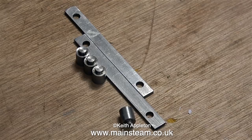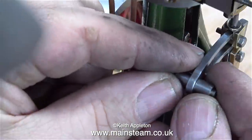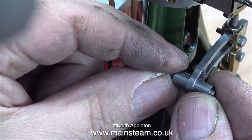Now it's time to make the pair of links that will pull the expansion link across the slot in the valve fork. These components are part finished. Even though they are dimensionally accurate, I don't know why the builder didn't drill the holes through the spacers when he made them. I'm going to have to do this, and also they're actually the wrong size — a bit too big — so I'm going to have to machine a bit off them.